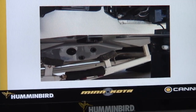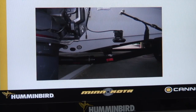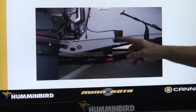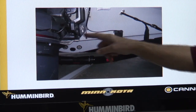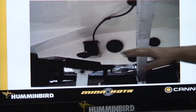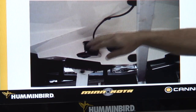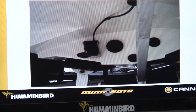Other boats aren't mounted that way, but they're working on some other transducers that will be able to be mounted a little bit different — so maybe that's the next thing coming. I had to get this one below here. If I put it up here, I'm going to hit the side of the motor and I'm not going to see off that left side. So I have to get it below the motor mount. Here's a Ranger — it's concaved. I had to lower it way down here to get it past that corner. So I had to get it low enough to stick out.